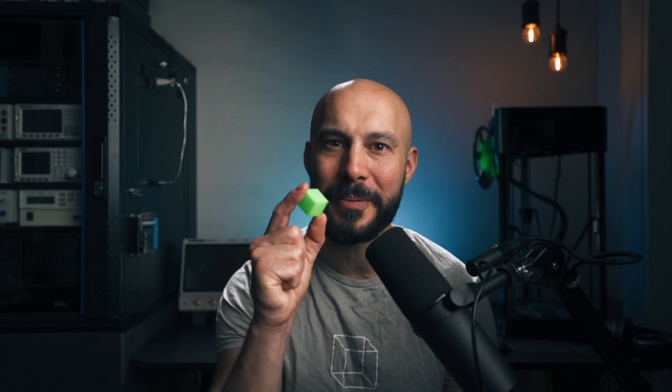Finally, Recore has taken its first micro steps and printed a calibration cube. It was done on a board running vanilla Linux and without a separate microcontroller for the steppers — instead it was done using the AR100 CPU embedded on the AllWinner A64.